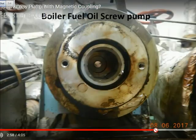If you see the other side, this is the motor side. The motor is fixed and you have the magnetic coupling here — the other part of the magnetic coupling — which will go inside. While you are taking it out it will be a little difficult because both magnets will be holding it, so you have to pull it straight horizontally to take the pump out.